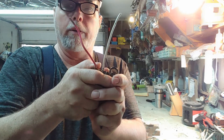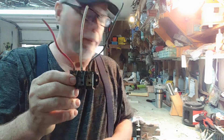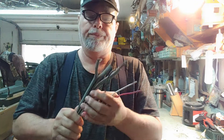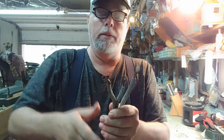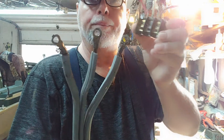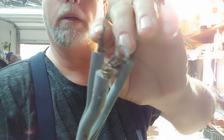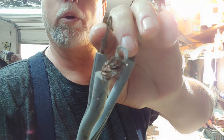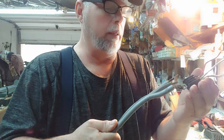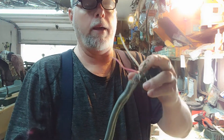If you only had a ground and a hot, that's 110 — either way that'll be 110. Now your dryer wire has three plugs on the end of it. They look just like this. Most of the time you can tell — see that little indention in the wire? That's always gonna go up, in the up position on this block.